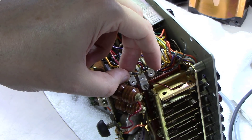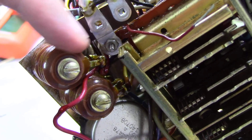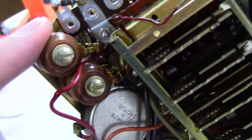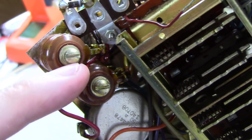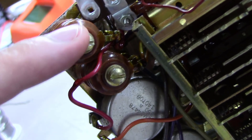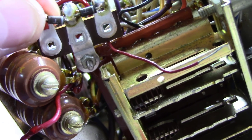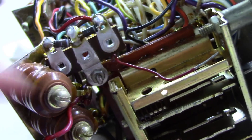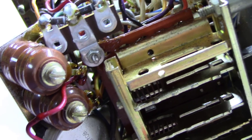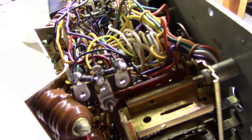You can see that thing will bolt right there perfectly. That's why I spun this — these two little lugs here, I had to get them turned because they were sticking straight up and one of them would have touched the tab. Just loosen this, turn it a little to the right, and tighten it back up. You can see here how I've connected back to the original lug and how this thing is now held on here nice and firm — just need to snug that up a little bit.